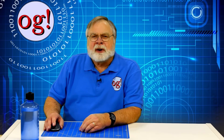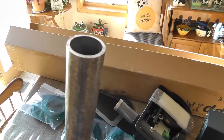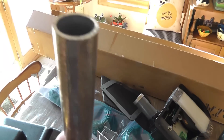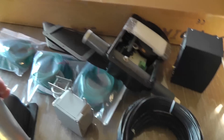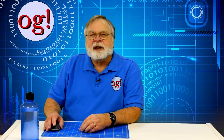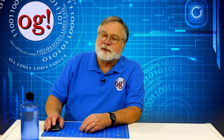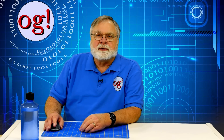Everything is constructed very, very sturdily. This right here is the two-foot tube that you're supposed to put in the ground, preferably in concrete. I'm going to reuse the tube that is already there for the Butternut, which is 22 inches deep. This tube is a bit too long for that, so I've got to work around it using a piece of three-quarter inch iron pipe. In the next video, I'll show how the installation went. I've got lots of video of the installation — it took us an entire day working very hard to get everything in place. We did a lot of testing, and I'm very happy with the results.